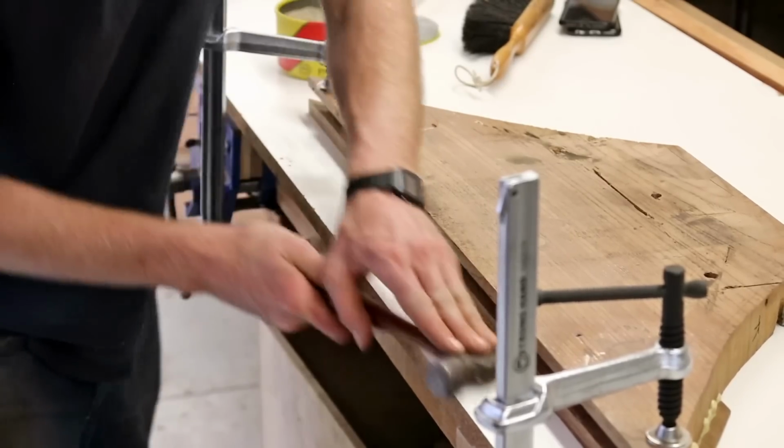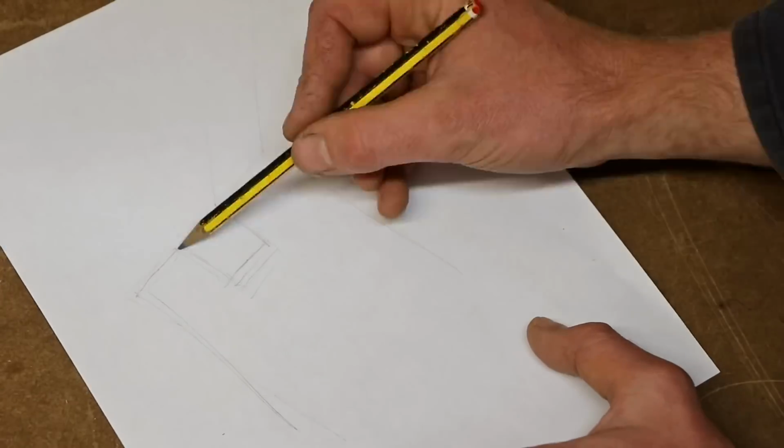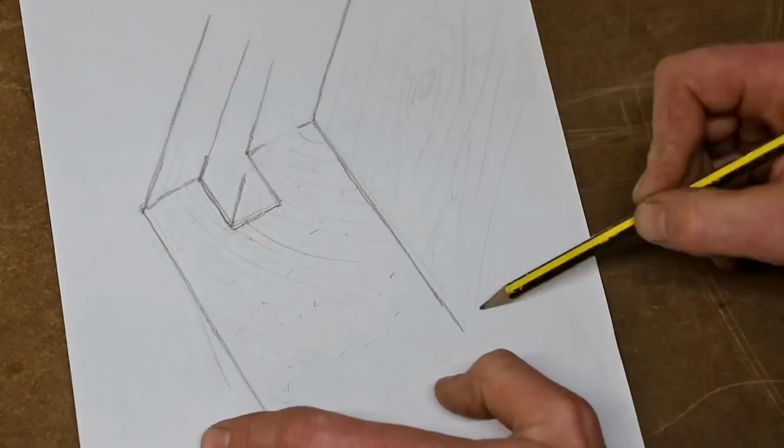Now, to make sure that those seams are definitely watertight, I'm going to use an old trick, which is to create a depressed line along the edge of the planks by pushing in the grain of the timber. With a small depression on the edges of both planks, that'll create a very small hollow into which I'm going to place a very thin strand of caulking cotton.